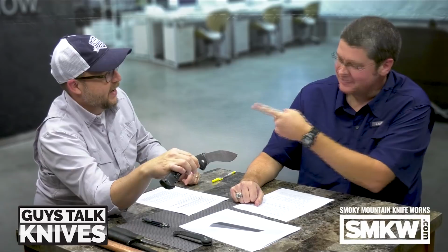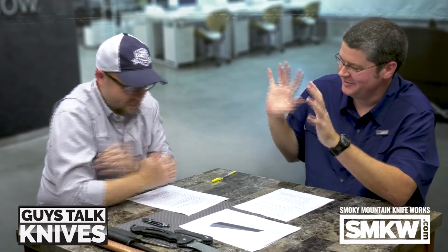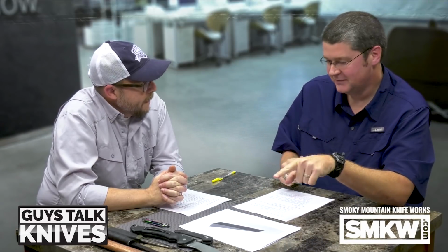Well, excellent lead in there. Okay. What's the secret to sharpening a knife? I have no idea, Jason. If I did, we wouldn't be having this two episode parts. Okay. And this is, I'm bestowing the knowledge. Please do. The two secrets to sharpening a knife is keeping the exact angle you want between the abrasive and the edge of the knife. Right. And as that blade shape changes, and we'll talk about this in a bit, how you're going to hold the knife against the stone changes. Right. And the second thing is taking away the amount of metal you want to take away.